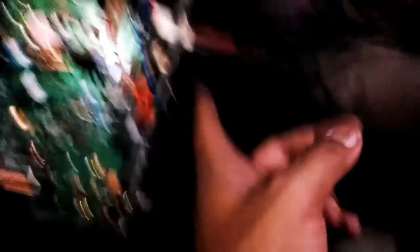I would like to take note that this unit doesn't have a COR right now, and there is no attachment COR inside, even though on the outside layer. I have already detached some wires on this unit. Before I convert this to a repeater I would like to check this first. I have already restored the connection at the back panel going to the speaker jack, connected to an external Bose speaker. Power on.